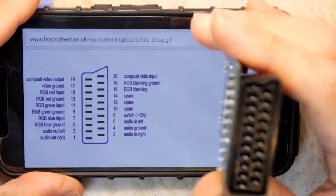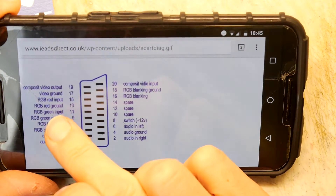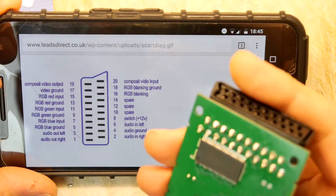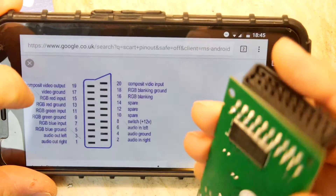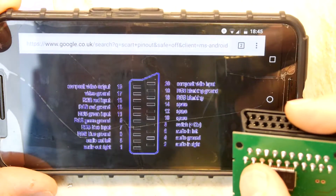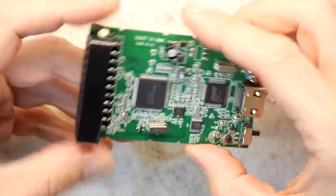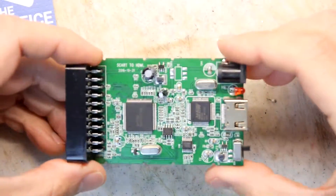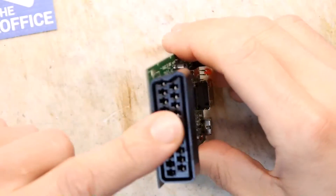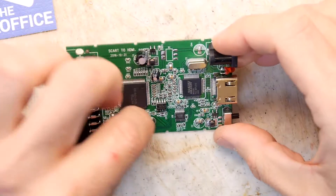We have the pinout here and we're just going to look at these side by side, imagining the connector going in. RGB — red, green, and blue — they're all along the bottom row here, and there's a whole bunch of them. But composite video out — you can see composite video out is the pin that's actually hooked up. So yeah, that does look like it's only considering composite. That's a real shame. This isn't going to work out for me with the Atari ST, but it will pretty much work with anything else like a Mega Drive. It looks like you've got the full SCART audio capability, so you'll have the sound go straight out the HDMI to your TV — that's going to be great.